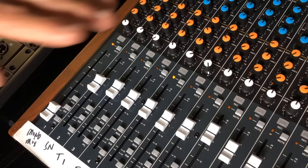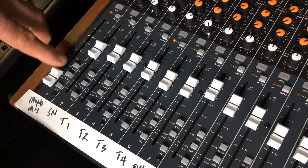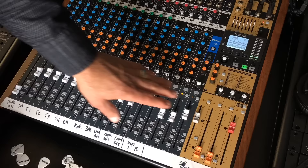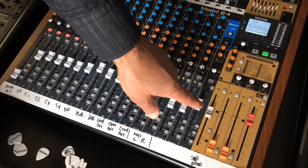The next section is a mute switch — quite simple — and you get a light indication when you're in there, so it's a good visual right away. Right below that, we have a 100-millimeter fader — a nice long-throw fader for great detail control of your mix. Right below that are your output assignments: 'main' goes to the main master output, and then we have a sub assignment. Over here is a stereo submix — for example, I'm submixing all the drums to this so I can control the overall level of the drums in relationship to the other tracks.